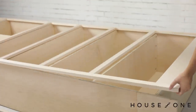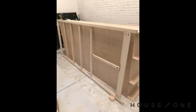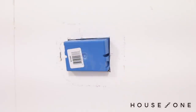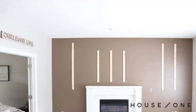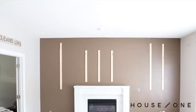I flipped the face frames over to check their fit. With all the major assembly work complete, I enlisted help to flip each unit on its side so I could give them a few coats of paint. As a last bit of prep, I cut recesses for the electrical boxes and installed furring strips over the studs on the walls to create a cavity to run the wires to the new television and to act as the nailer for the shelves.